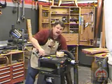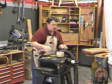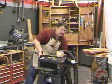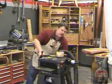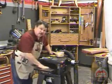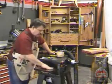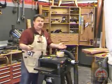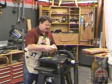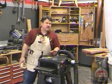Let me tell you a story. I was on the committee with Jim McCann. We were doing the testing on this planer when it was being designed, and we had a meter on the planer as we were running some really wide, really hard maple through it, and it was maxing out at about 20 amps, and we were worried that if we sold it like this, it would blow circuits. And Jim says, just wax the table. And the engineer that was there said, oh, that's just an old wives' tale. So Jim did it anyway, and the draw on the amperage went down almost 50%.